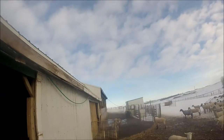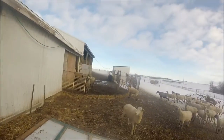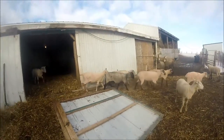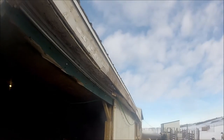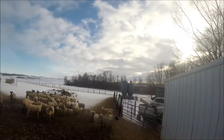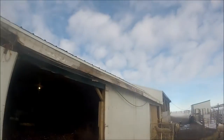To be honest with you, it was a crappy idea because garage door track doesn't have any way to lock the rollers in. It's beveled on one side but flat on the other, so the rollers pop out quite easily. They knock this door down all the time and the door is just getting busted. When we let the sheep out, they all want to go through the small hole at once, they bash against the door, and it just pops right out of the track. So we're putting actual barn door track up here — I finally convinced dad to spend a little bit of money and do that, and I'm going to be installing that today.